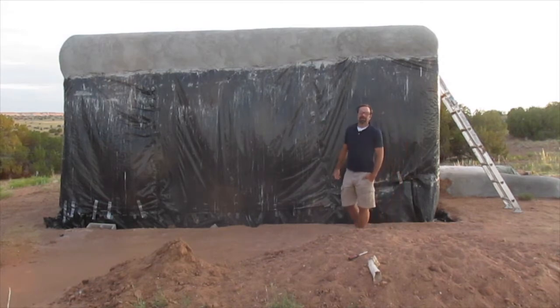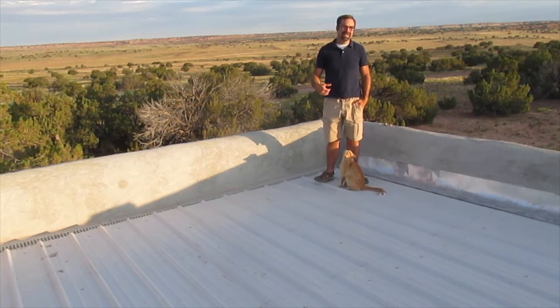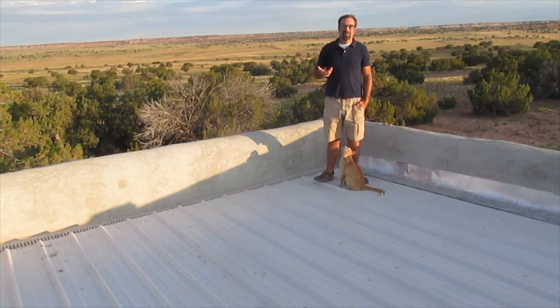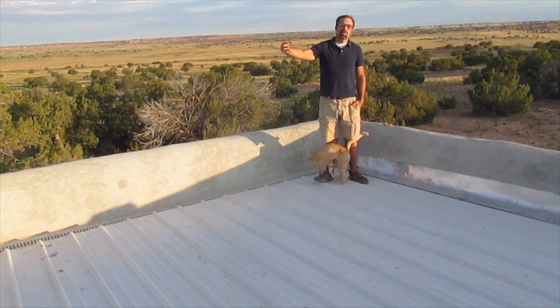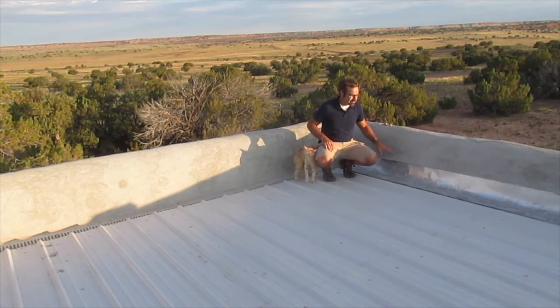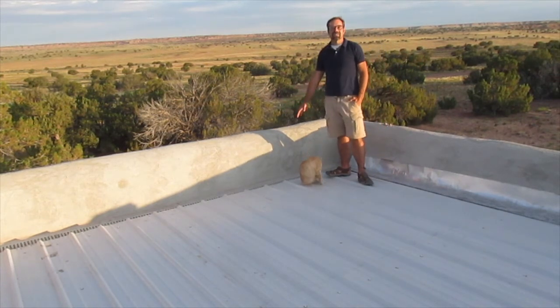So let's go to the top and check out the roof. Here we are on top of the roof and my cat has joined us — it's a seven foot jump from the retaining wall to the top of the building. You can see I've chosen white as the color for the roof, and that's part of the passive design of the building. In the summer when the sun is mostly directly overhead, the white will reflect a lot of that energy back, keeping the building cooler. In the winter when the sun is lower in the sky, it will hit the walls, heating them up when I want that. You can also see aluminum flashing that covers the seam where the roof meets the walls, and when it rains, water will flow off the roof into this gutter system over here.